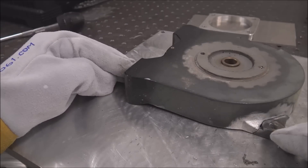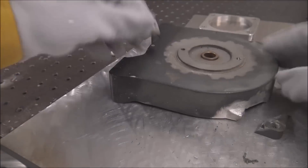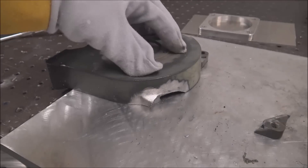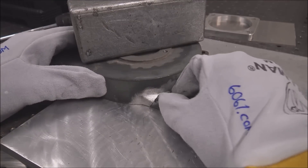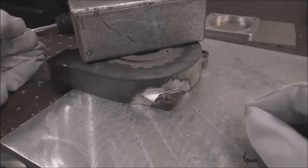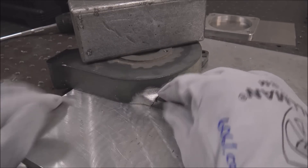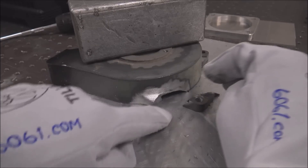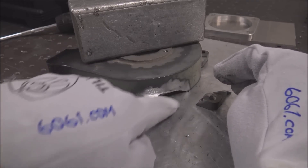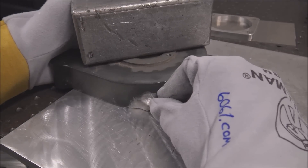For this ear, you want to make sure it's as flat as possible. See how this part has a little raised ear here — so I have to hang it off the edge, make sure that's nice and flat, put a weight on it if you need to. A lot of times when it breaks it'll peel and you'll have spots that keep it shimmed out, so you have to come in and file and grind down any spots like that so it fits as good as it came from the factory.